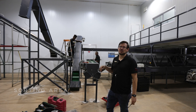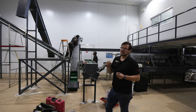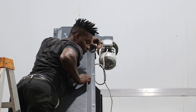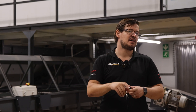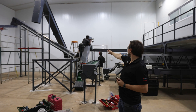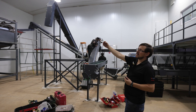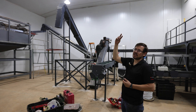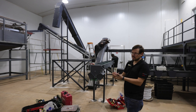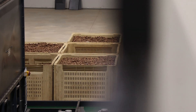This area is the final sorting area. After drying in the drying room, nuts go through final sorting which is a very slow, very accurate sort. We're installing a multi-scan optical sorter here to reduce labour and increase throughput. Good nuts will go over the sorting tables again as a double sort, then up through a sizer which splits them into two outputs: smalls, and mediums and larges. The client can choose whether to separate large from medium-and-small, or small from medium-and-large.